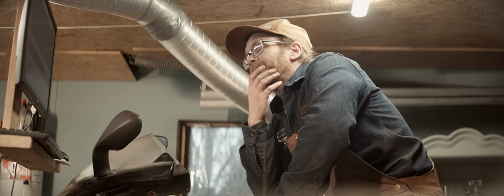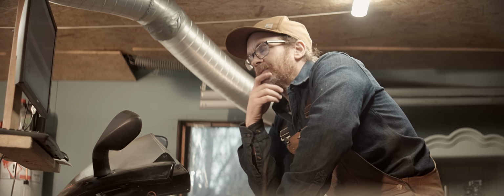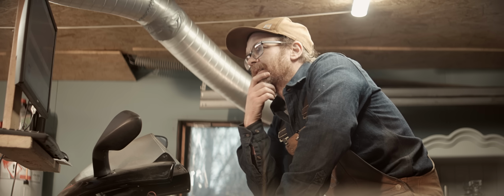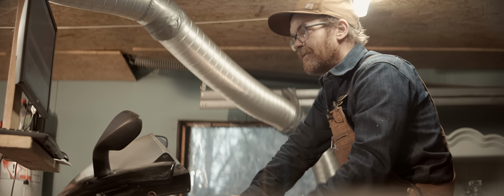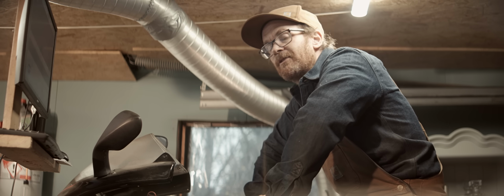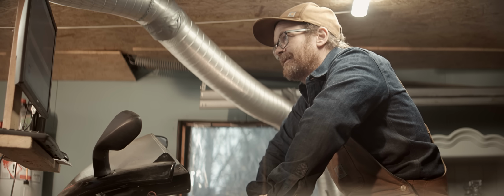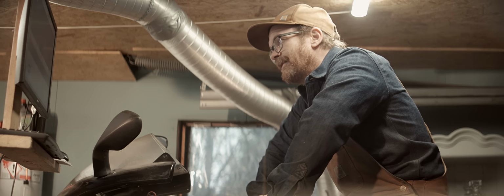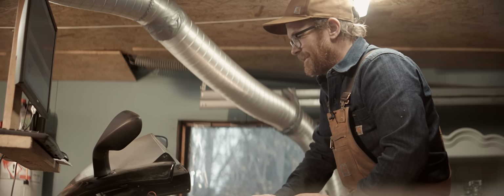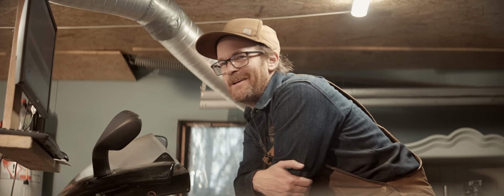We'll just have to figure out what's going on. I'm going to hook up the EGT probe to see how the exhaust gas temperatures are acting, and that can give us some clues. And check rotary valve timing, and play around with the ignition timing and fueling, and see where we can get. And then we can start working on optimizing the cylinder, or actually making it work. More like, because I feel I know how to make a cylinder be powerful, but too much experimental stuff, probably, like always with me.